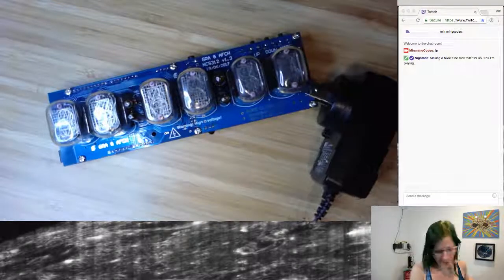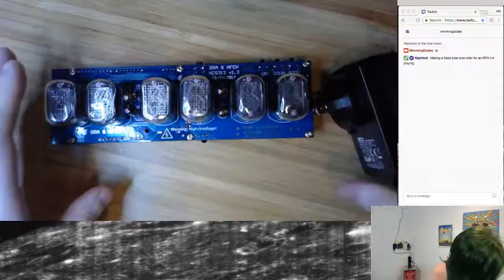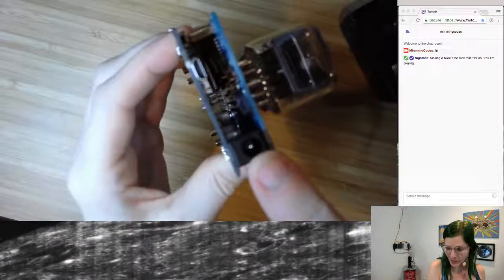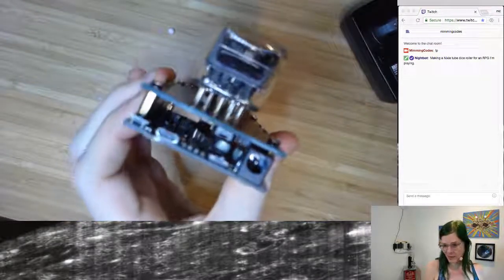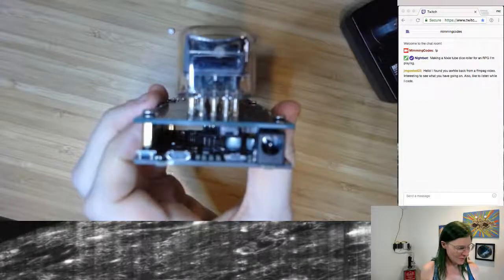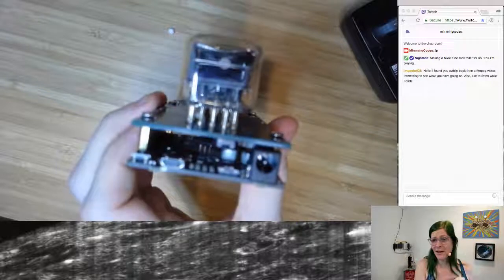And I'm back. So I went and got a power supply for it because this device requires 12 volts of input. One thing I didn't really realize before I started tinkering around with this project is the Arduino's main power input is pretty forgiving on different levels of input voltage. So generally, like a 5-volt input is usually what I stick in there, 5 to 6 volts. But you can put in there like up to 20 volts and it will work fine.